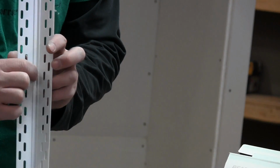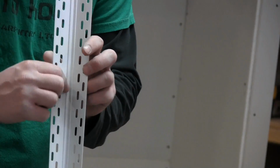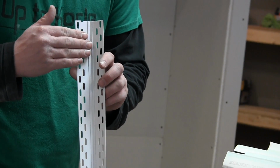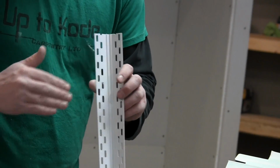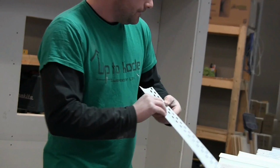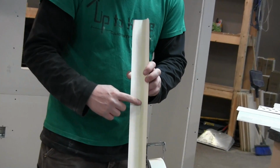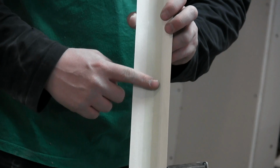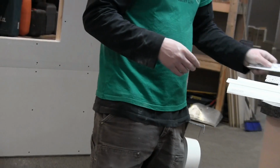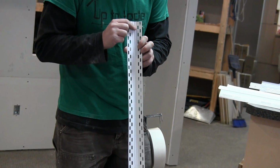Plus, it has this little ridge here, and it's a lot easier to set it to the angle and make sure, like when we do it, you'll see you have to make sure that it's not offset so that the mud always fills it. I'm not explaining myself well enough, but you'll see what I mean. These are better because on this one, when you do one side at a time, it's hard not to travel into the other side of the angle, and then it's hard to get a nice straight line, right? Whereas this one I find to be better just because it does have this lip here. So this one's kind of good for that. It's really neat.